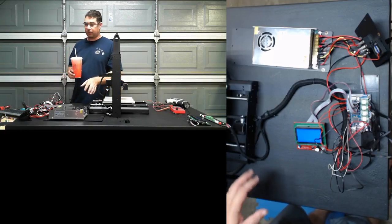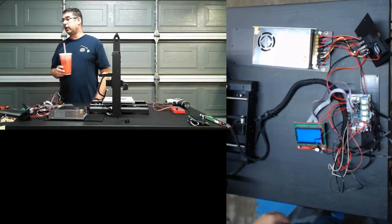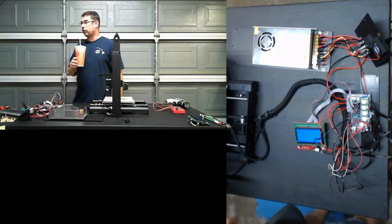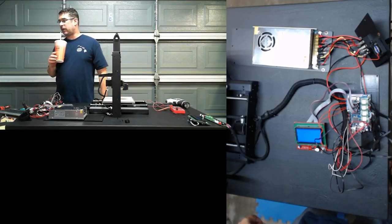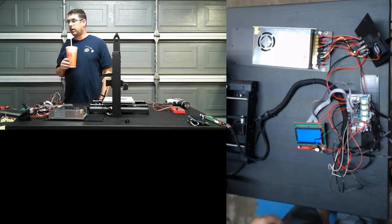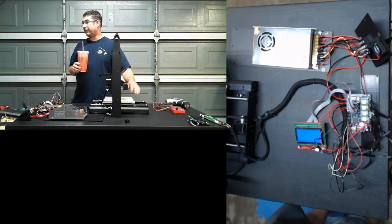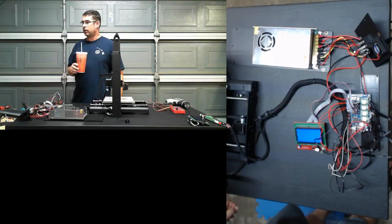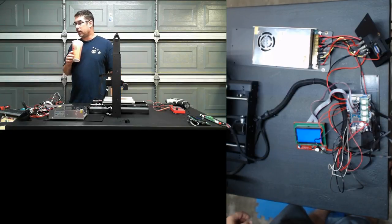Blade Runner, the biggest improvement I believe that we're potentially going to see out of this is the ability to add a BL touch or other type of leveling device. And as Aspie said, it is a 32-bit board. I don't know if on this particular platform we'd necessarily see the benefits of 32-bit as opposed to a much larger printer or a Delta, but it definitely doesn't hurt.